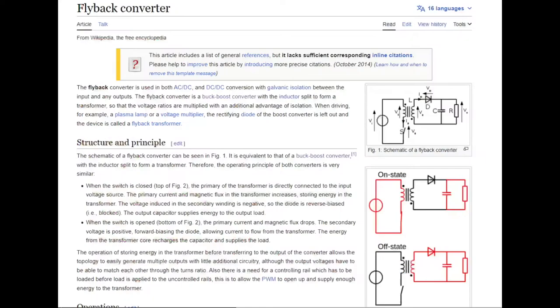This converter from Infineon and its eval board are all about how to charge these batteries. These batteries are 100 to 250 watts and 48 volts, so you basically need something that takes mains AC power direct to DC. Because you're dealing with mains power you want to be safe and use something like a flyback converter with isolated output — that transformer gives you isolation so there's no risk of the hot or neutral accidentally touching the metal case of the battery or the bicycle frame.